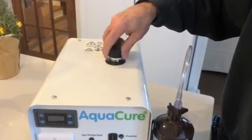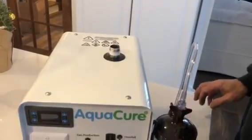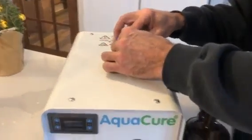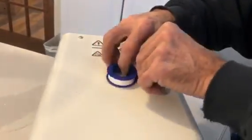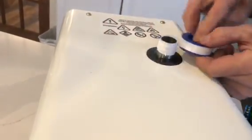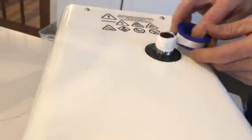We're taking the cap off and setting it aside — that's the cap used for shipping. Then we take the Teflon tape and put on plenty of it, usually about 15 to 20 wraps. The tape is pretty thin, so at least 15 to 20 is better. We wrap it right around the top threads; we don't worry about the bottom threads because the top threads are what seals.